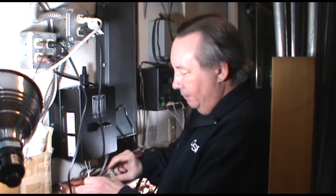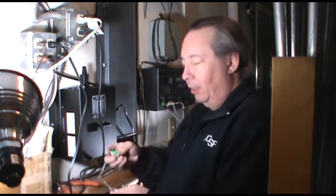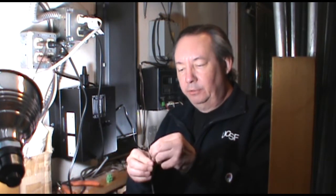That plugs into our console input. Then, to go out to our decoder cards, we have a three-pin connector that connects onto a chain. I'm using a low-impedance audio cable — a pair of wires and a shield. The shielding is important because we're sending a digital signal with pulses going through thousands of times a second, and those pulses can be disrupted by radio waves in the air. Shielding takes care of that by providing an outside path to ground, so if a radio signal comes in, it goes to ground and dissipates, and the digital signal continues on uninterrupted and uncorrupted.